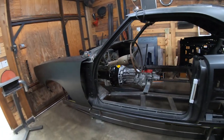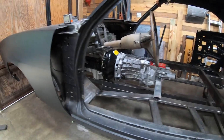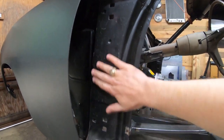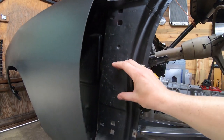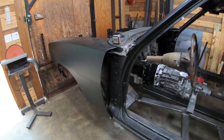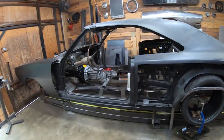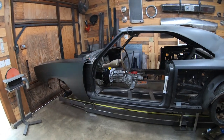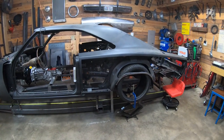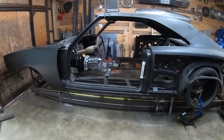Same thing, same exact idea, a U-shape, almost like a football upright, is going to come up and grab this flat spot where the door hinges mount. Door hinge 1 and 2, and then this nice perfect flat spot. Mount a plate here, extend out, and the upright will be right here so that the car and its shape and dimension is secured externally. And when you get the body and all that shape locked down, I should be able to cut out the entire frame from front to back, and then very, very carefully, without using a lot of air hammer, quite frankly, slide the thing out the front.